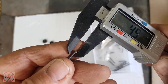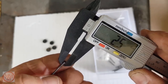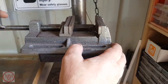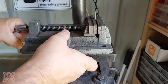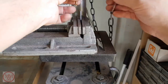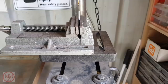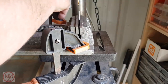What size drill do I need? Well, it needs to be at least the diameter of the original head of the axle. This one is 2.5mm in diameter. I've got this vice clamp here, which I'm going to use to support the nail whilst I drill the cup in the end of it. I position the nail in the portable vise and try to get it perfectly vertical. I've got my 2.5mm drill in the chuck and I'm accurately lining it up with that small center punch mark. When it's all aligned, I clamp the portable vise into position using these woodworking clamps.